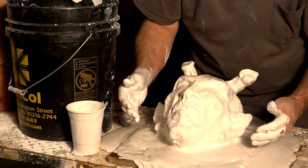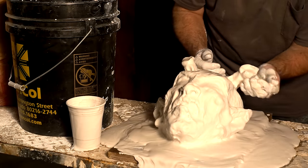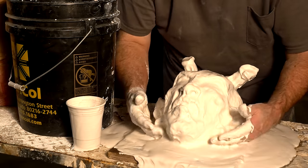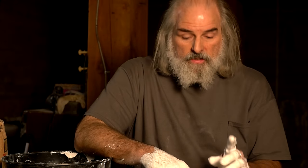The plaster will set, but you get to a point where it's too runny to keep pouring plaster on, it just runs off. And that's okay. You can check out your sculpture thoroughly. A lot of times you'll miss things like undercuts. So at a time like this, you could try to not disrupt it. It's not going to hurt it at this point, but just make sure you're getting all the undercuts well, even though they're hard to see. And then you just chill for a few minutes till it's a little bit thicker